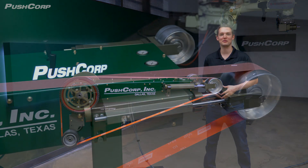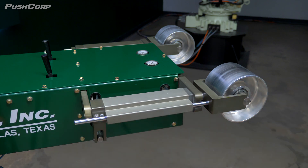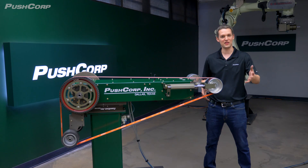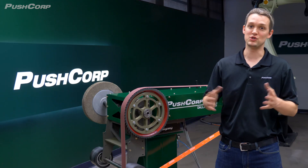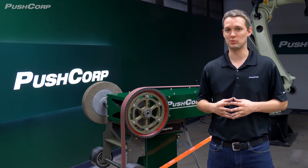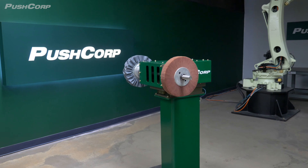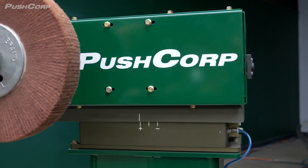Belt changeouts are a breeze. Flipping the switch on the top of the unit activates the pneumatic cylinder and retracts the crown tracking wheel. The wheel's angle can then be adjusted to center the belt in the middle of the contact wheel. Together, these mechanisms make changing the belt a breeze. The unit can run two different abrasives, one on each side — this can be two wheels, two belts, or a combination of the two. This is particularly helpful if you need to run through a sequence of media. Other projects may require multiple grits, or you can duplicate the same media on either side for long life. If only two wheels are needed, we offer a servo finishing stand, which is basically the same hardware minus the tracking and belt brake sensors.